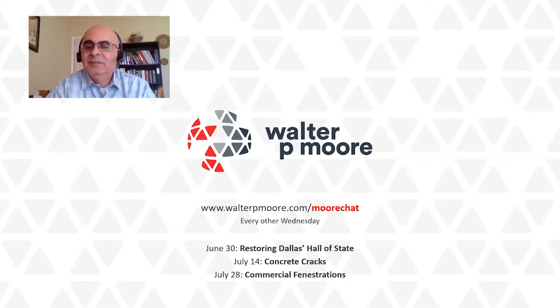We have a question in the chat: can existing frames damaged by thermal loads be repaired? Yes, they can, but it comes at a major cost, especially the downtime. The slide I showed was from an actual building that we eventually repaired. To repair it, we had to cut the braces from where they were, move them to the center, and we had to widen the joint — which is really difficult when cutting very thick steel plates. During that process, manufacturing has to stop, and it comes at a very high cost — not the construction itself, but the manufacturing downtime is truly the major cost.